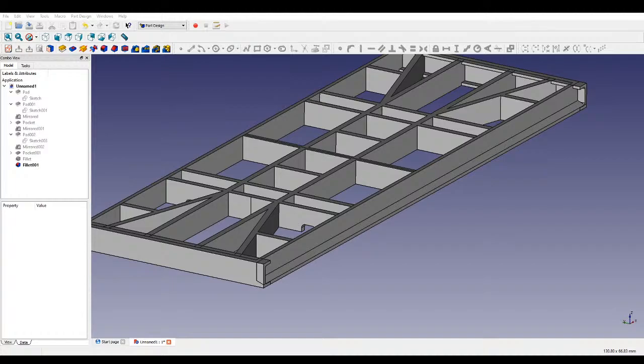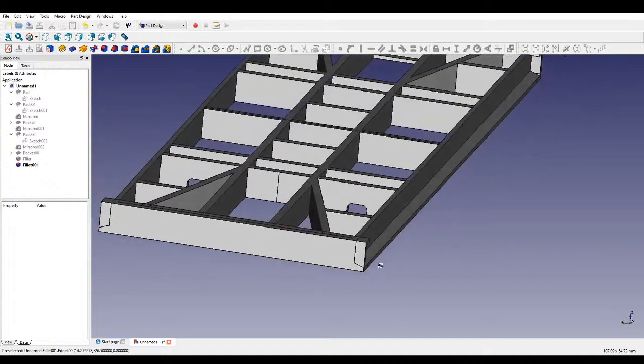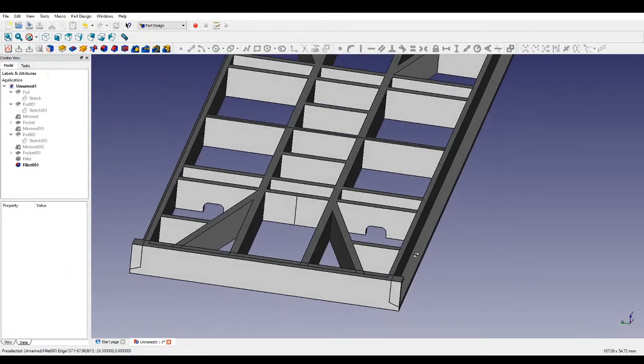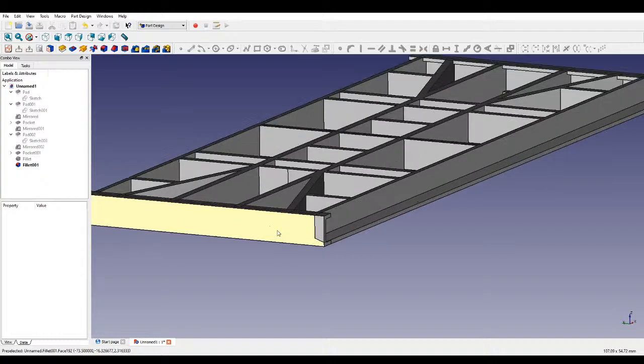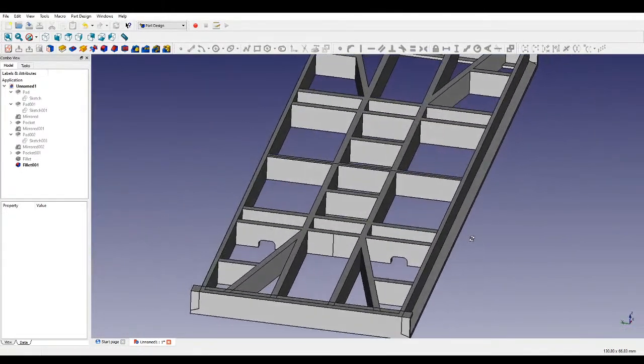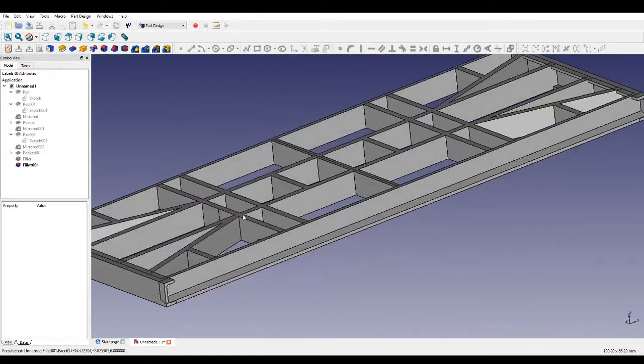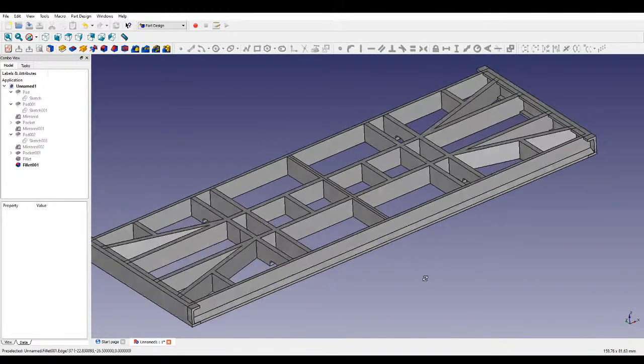The drawing I have is very, very light on the detail for this element. Some things this is going to be very difficult to cast, like this corner piece. That almost certainly ends up with the end of the frames getting chopped off. But that'll be something I'll discuss with the person when it comes to casting. As if this is put into a train and it needs to have a lot of draw weight, there'll probably be a piece of brass set into the lower end of the frames, which will present its own problems, but I can deal with that when it happens.